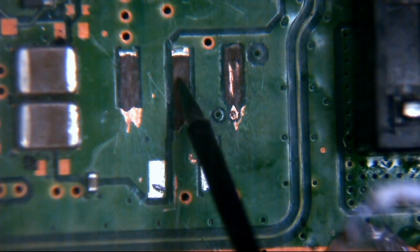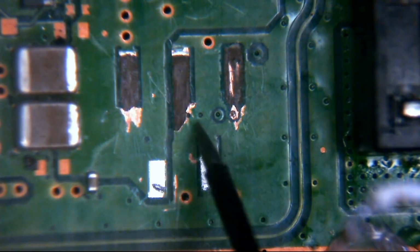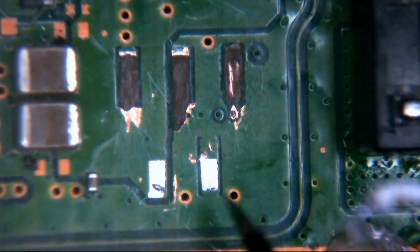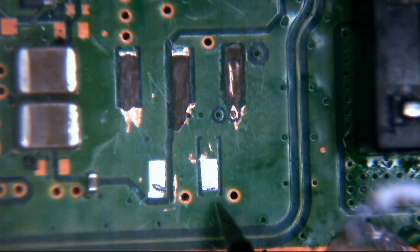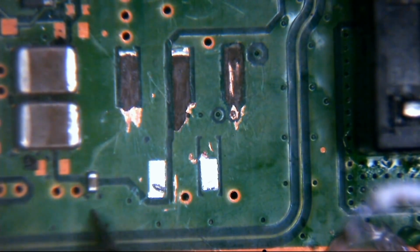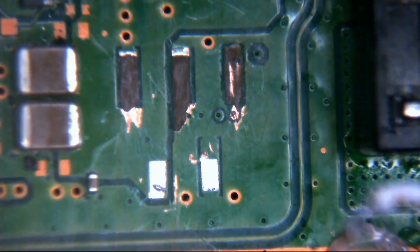This one here just looks like ground to me. There's nothing here. If you take a look here, you can see there's two lines that sort of separate out, but this pad just runs into this wide open space, and it does the same down here. All this space around here is a big open space. Essentially, that's usually a pointer to ground.